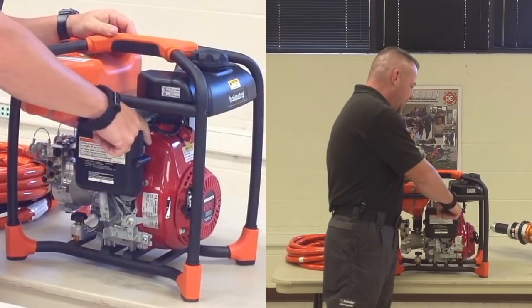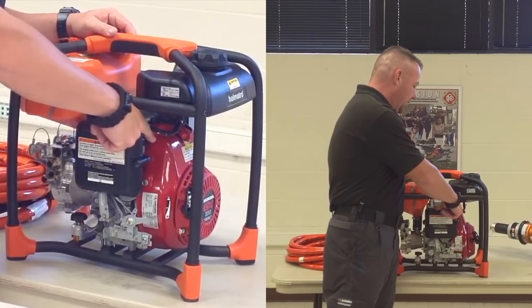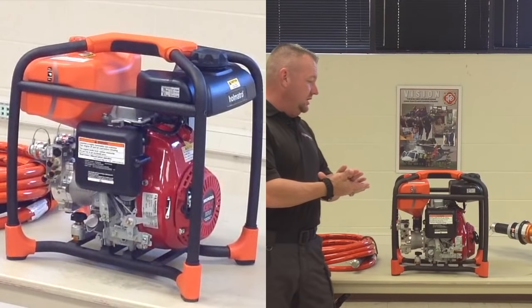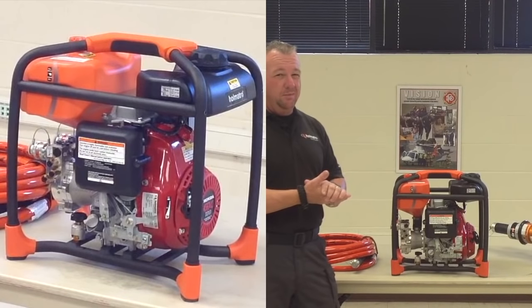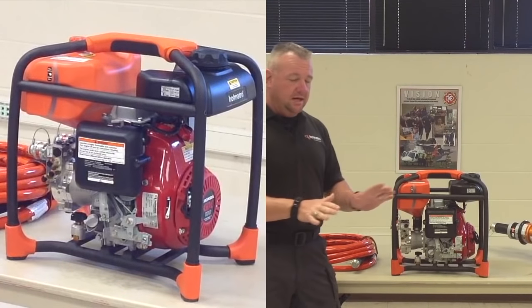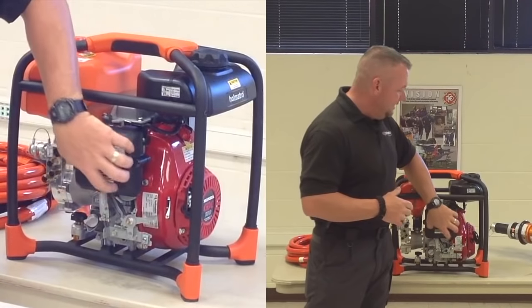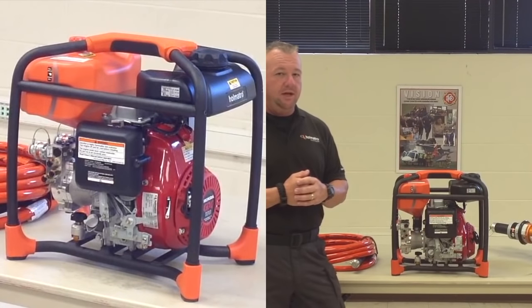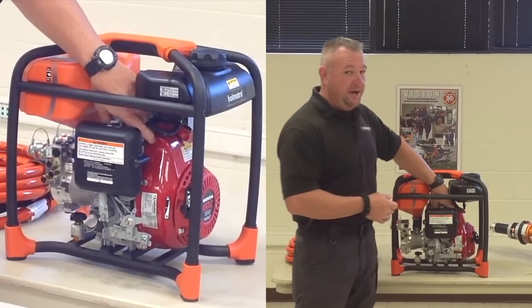On top of the carburetor, right behind it, you can also find the fuel valve, indicated as an on or off position. At this department, the recommendation is for you to turn the fuel off when you complete your operation of the unit. Let the unit run about another 15 or 20 seconds — not till it shuts off, just another 15 or 20 seconds — and then turn the unit back off. That removes any excess fuel from the fuel lines and will keep you from having flooding issues from bouncing around in the trucks. Remember to turn that fuel back on when you start it.